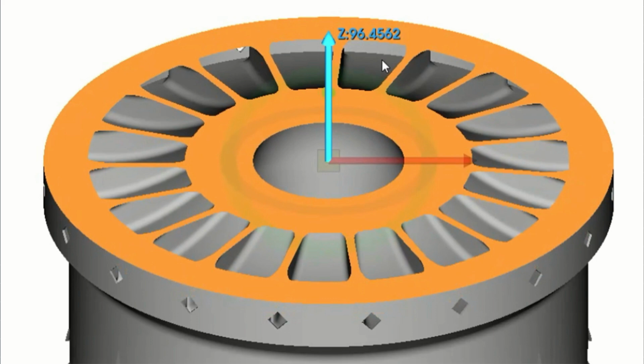Exactly. So you have to imagine that the process of printing that part is quite simple up until we get to the upper edge of that shroud, that perforated shroud around the outer circumference of the part. From that point on, we are growing that shroud inwards and up. If the angle is lower, we are more biased towards growing it inward. If the angle is steeper, we are more biased growing it upward. And with each layer, the diameter of that leading edge is getting smaller and smaller.